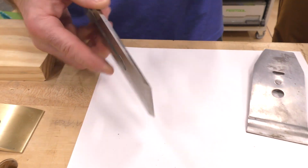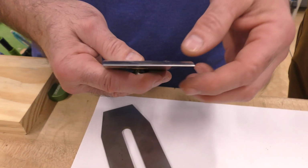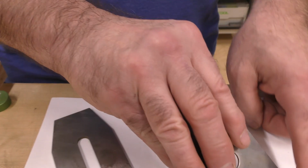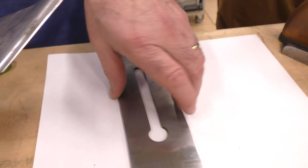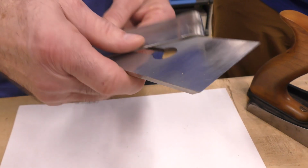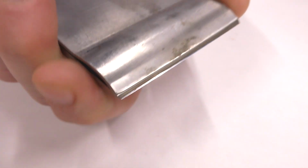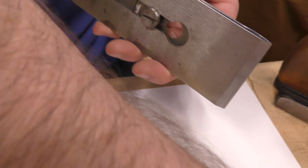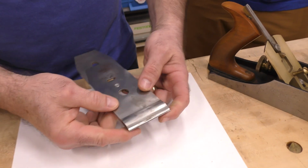That's number one. Now, setting up this blade in the hand plane. This is known as your chip breaker. On your record that we took care of and cleaned up, I actually showed how to make sure that it is honed, but I also stropped it to make sure that it is wicked smooth and dead flat. So the way you put on a chip breaker is just like this, and you rotate it. Now the other thing that I've seen people do on hand planes is they chuck it up here and think that's good. I usually like to bring it right down there, because when that curl comes up, the chip breaker breaks the chip. Then I'll take a screwdriver that I always have, nothing fancy for me, and just tighten it up. So there's your chip breaker and it's set.